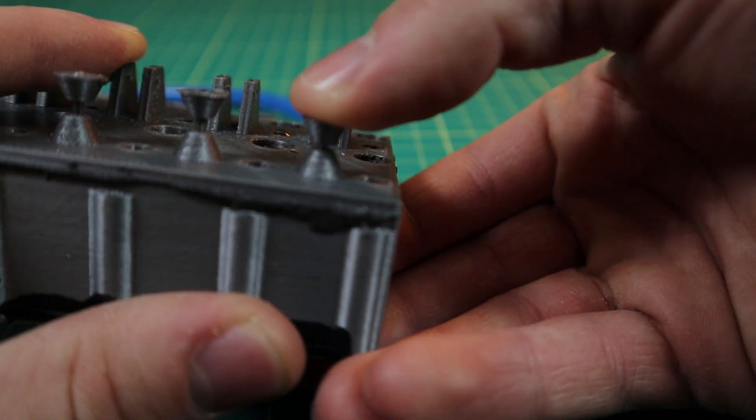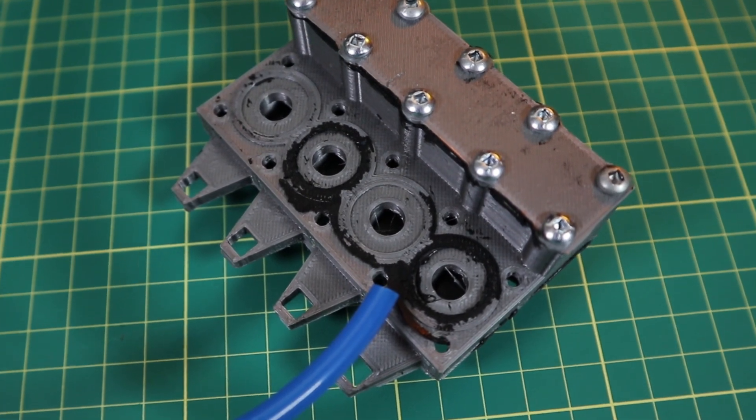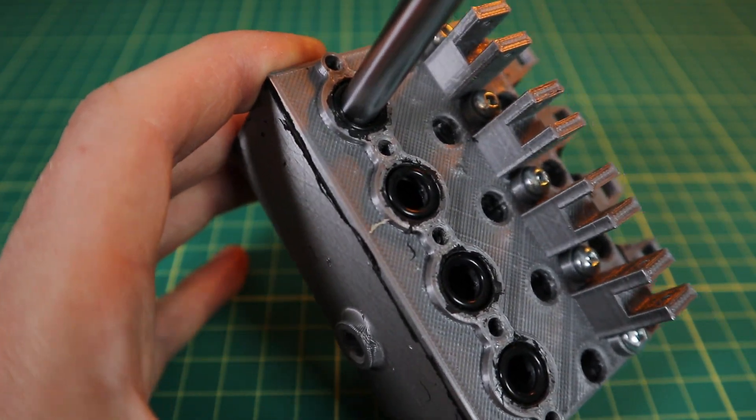Only shortly after assembling the head, I knew that something was wrong. The valves didn't really have a lot of travel and they weren't letting a lot of air through. There was also a lot of play between the valve stem and the walls surrounding it, which is going to let a lot of air leak by. Overall, the airsoft BBs and the passages leading to the cylinders are just too narrow and constrictive. When thinking about redesigns, I considered using O-rings and a steel rod, and this led me to design a new head which uses O-rings as a valve seal. By covering the rods in grease or oil and slipping an O-ring over them, this should create not only an airtight seal, but also let the valves move up and down without much resistance.